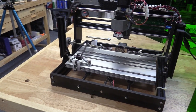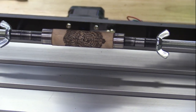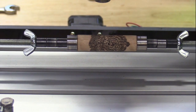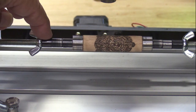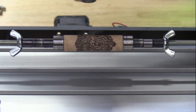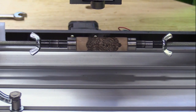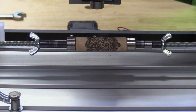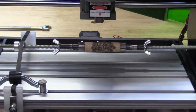We take the pen blank along with the bushings used to carve it, and I have three spacer bushings on either side — all seven millimeters, so they're very close to the quarter-20 threaded rod with just a little bit of play. We lock them down with butterfly nuts on both sides. As we'll demonstrate, this works very well and is very precise using this type of belt system.